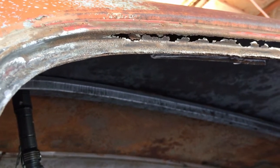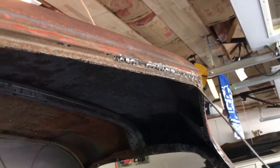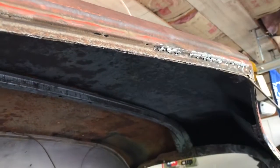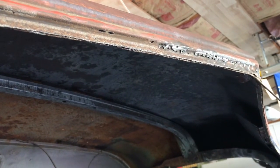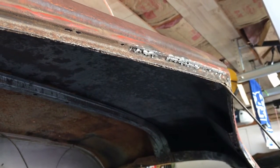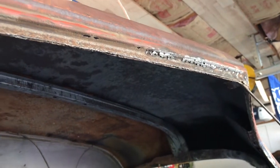And I think if I really need to fill it, as I'm over there, the welds, I'm trying to fill it with metal and it's just not coming out right. So I've decided what I'm going to do is just fill those pock marks with, if it's backed with metal, so it's reinforced, it's got its structural strength, I'm going to fill it with metal reinforced Bondo, or another product called Tiger Hair. I don't know which one's better.